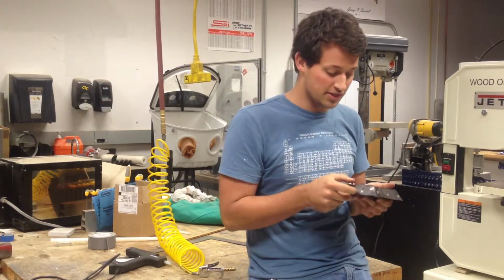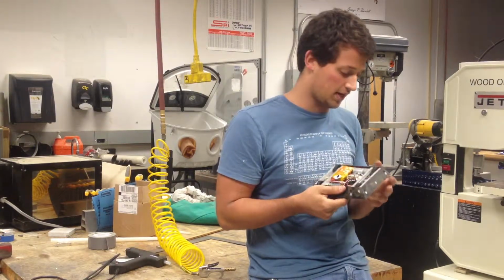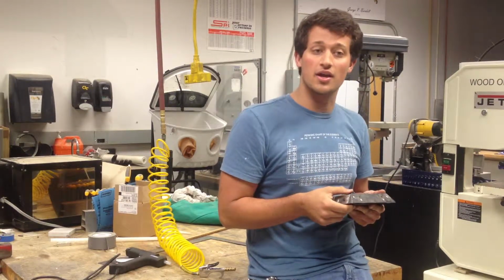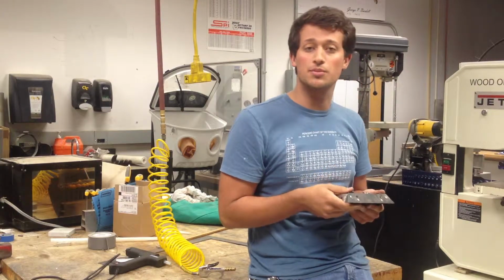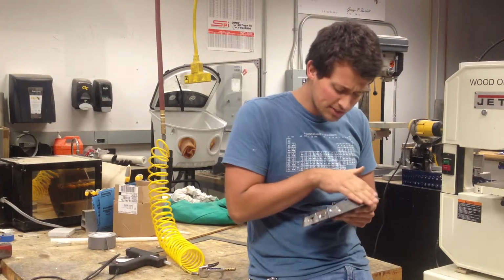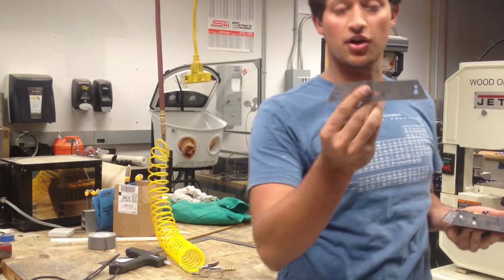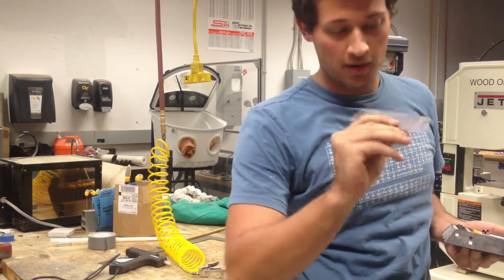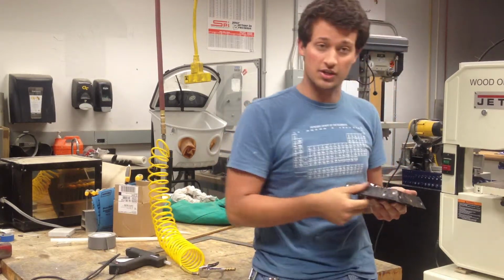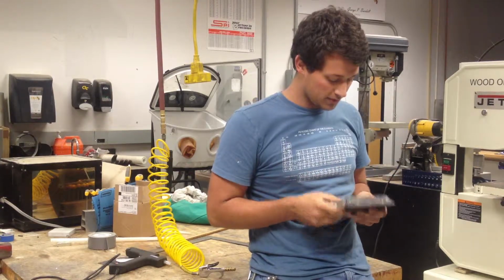The steel actually is 1095 carbon steel that we took and heat treated ourselves in-house. It was a very interesting process. Unfortunately, we don't have very precise temperature control on the kiln that we used, so it didn't necessarily give us as precise results as we would have liked. But as you can see on this other side that I took off, it came out fairly well once I ground the oxidation off the top of it from the actual quenching and tempering process. Other than that, hopefully it'll do well in a couple weeks.